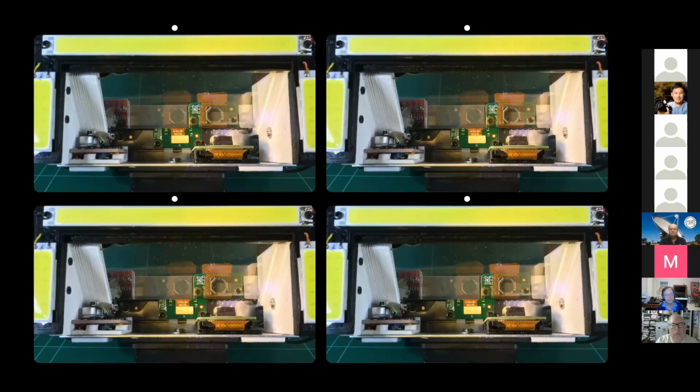So the left camera is mounted on the bottom, and it gathers the light reflected off the mirror, and then the camera at the back is looking through the mirror. The good thing about this is it means you can completely overlap the cameras, and for macro it's very important to get them close together. In fact, most of the pictures I take, I use a separation of only 2 or 3 millimeters. So having them overlapped is really good.